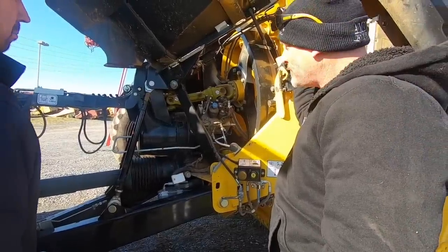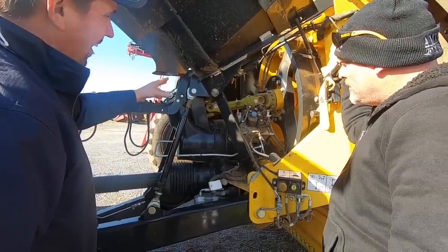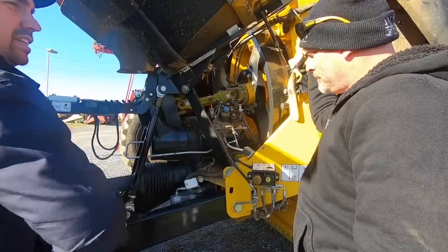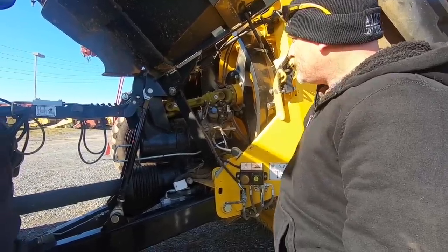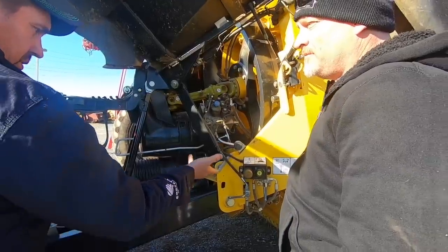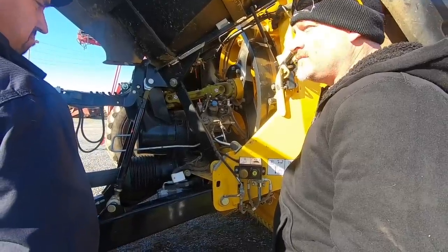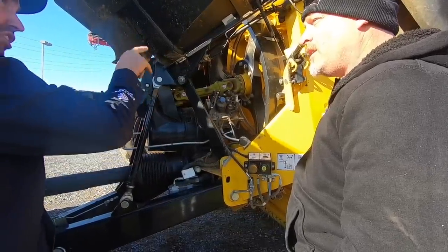Right. But this concept is here to brake it and keep the plunger out here, so when you go to start it, it's an easy start, away from the bale. Now, all I have is baler assist, where I can reverse everything with a keyless. I think I've used it 3 times. You just run it real slow, reverse, and watch it.